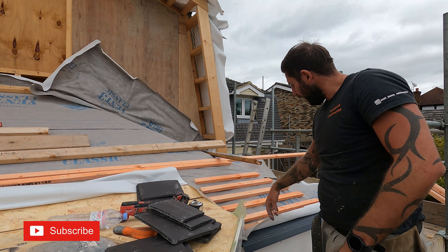Setting out. I've semi-set it out, I've just got some marks where the starting point is. It actually works out full tile there, just by a stroke of luck. Because it's a bit of a feature now, it may not matter. But I've used the centre of that window - so centre of this flat roof, centre of the window, centre of the tiles. So as the tiles lay in they'll all be equal and you'll have the same cuts on both sides. I don't think it'll ever get noticed, but because we're doing a bit of a feature I want to make it all uniform and look nice. So I'm going to start getting these tiles in. Chris is loaded out, he's got his grinder, ready to go. Let's get to it.